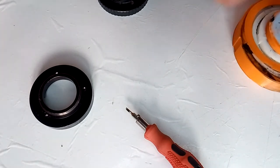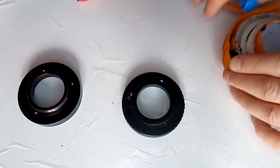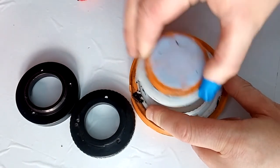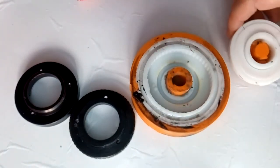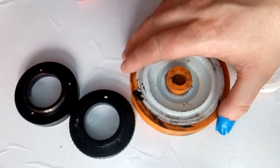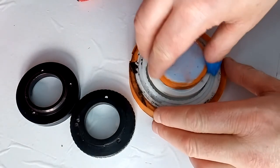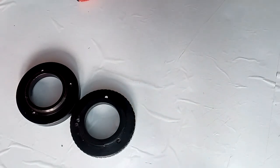Now, how I make these plates after 3D printing them is by basically casting them in a mold, which is also 3D printed. So the actual part is made from here, and it's cast out of resin. So it's quite tough, durable material. A nice re-engineered Zeiss lens backing plate, and it's easy to adapt, easy to fit on. I'm sure you wouldn't have any problems fitting that.